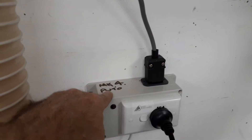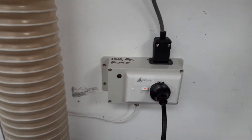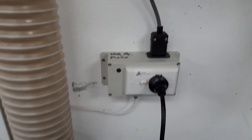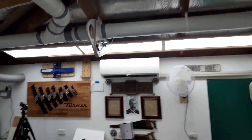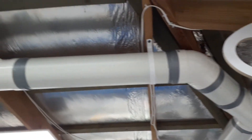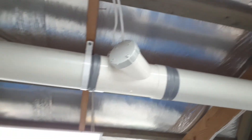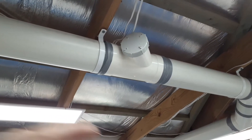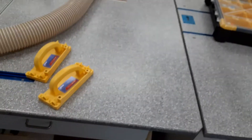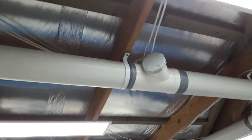Everything is in here. Apparently this is the first one made in Australia. When I turn on the dust extractor, this little red light will come on and it will open the blast gate up there as well. Coming down the middle of the room — this is the main line. I've put a 6-inch to 4-inch intersection here as a spare for later on, around the router table area, so I can hook up further down the track.